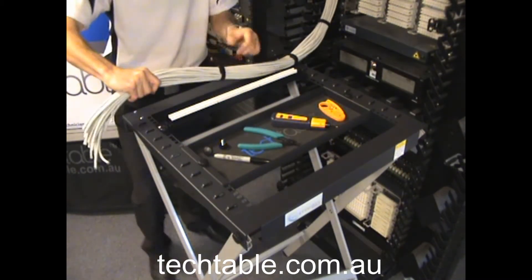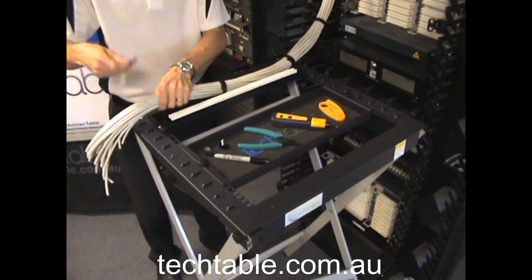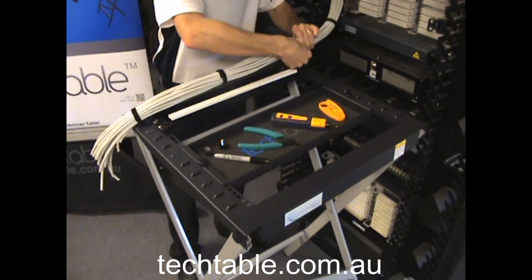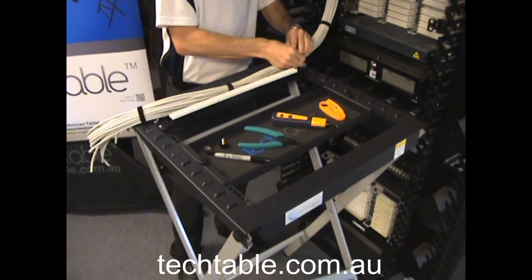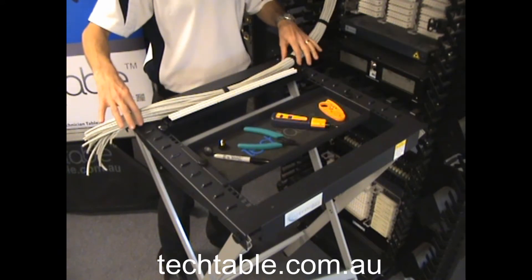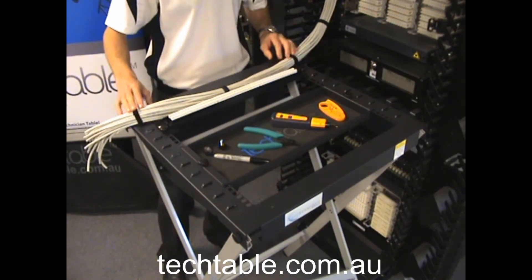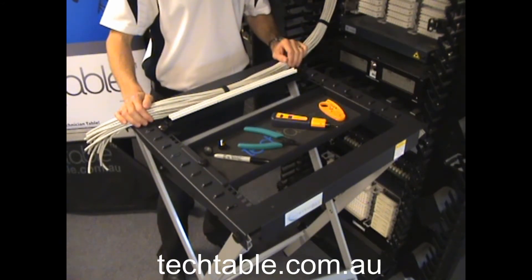The cable bundle — this is a 24-port patch panel, so your 24 cables. Use those velcro tie points or cable tie points, depending on what category cable you're going to be terminating, and just secure those on both sides. It's a fairly critical part to have that cable bundle contained throughout the termination process, because it means the technician is not having to try and hold on to that cable whilst they're terminating. It also means that when they go for a break, they can come back and the cables are exactly where they were when they left, so they can continue on with that termination. And that's increasing productivity as well.